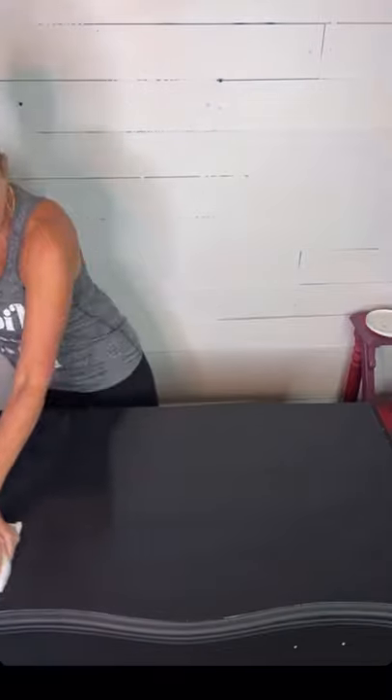I take my sponge and go around the outside edges where it has dripped off — just picking up the drips — and that's it. I'll let this set up and dry for a couple of hours. As it starts to set up, it changes tones and will look like you've missed big spaces, but let it completely dry. Get a good light on it and get down to the side to inspect it, like checking a clear varnish. The areas that look dry faster aren't missed — it just dries unevenly in places.